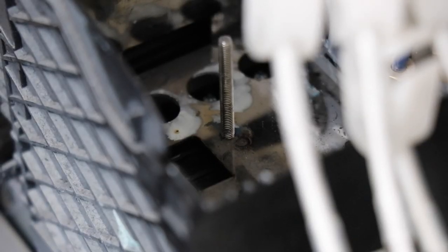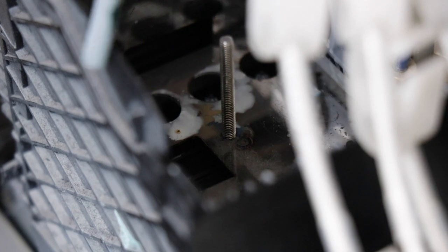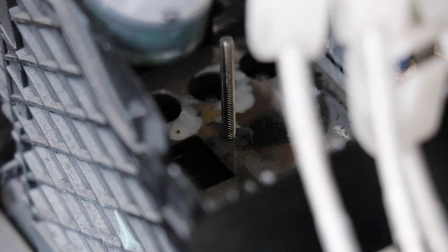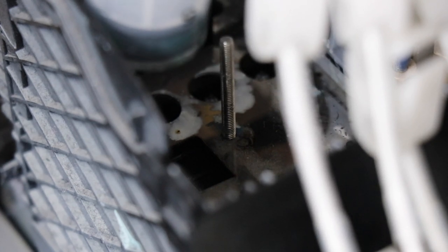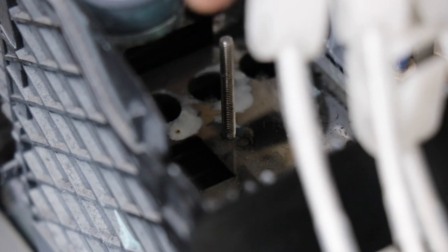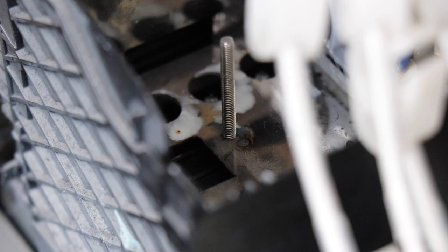Okay guys, so this is where that little tube piece comes in handy. This is gonna go on top of that little tip of your hose. You just filled up your wet cap station, and you wanna make sure the solution is coming through your print head. There are these little tiny things inside those little black holes you see right here. I call them mountaintops because they're white, like there's a little snow on it from the white ink. You're just gonna pull up to make sure solution is coming through. And it looks like it is.